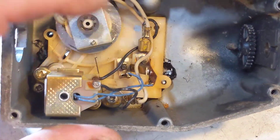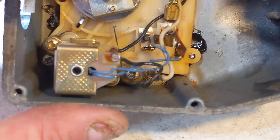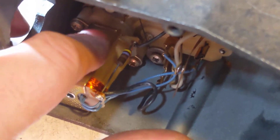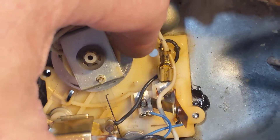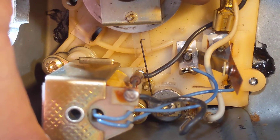I'm going to go to another unit so I can show you a little better. I removed the flyweights — this entire piece — and now you can see inside the unit. This is the magnetic clutch, and this is what I would call an on-off vacuum valve. The way they work is winding, so it creates an electromagnetic force and pulls a plunger up and down. I've had to fix the plunger, fix the seat, fix everything, including this hairpin. I'll move it by hand. When it's connected and everything's on, the flyweights will move this back and forth. It's connected to this wheel, and you'll watch that spring moving back and forth. To the left there's a slot — it's opening and closing with this piece of plastic over the top. That mixes ambient air. That's basically how the whole thing works.